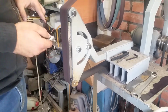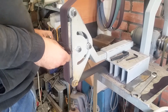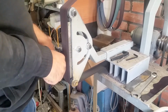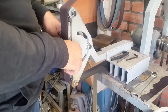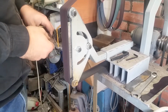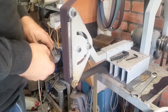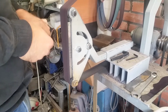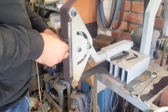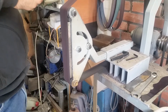And I'm using 4.5 millimeters thick material. So if this knife were thinner, those bevels would make sense, but you need an acute angle to make the knife cut well, and I wanted it to cut well because I wanted it functional. So yeah, this was a design choice, and this was me correcting my mistakes, going higher, but it turned out pretty damn great. You will see that in the end, and I encourage you to check out my Instagram page.